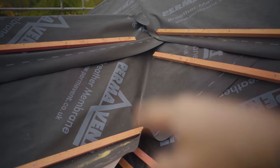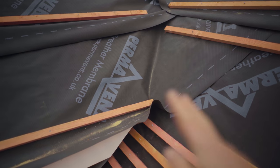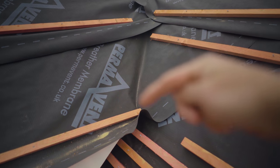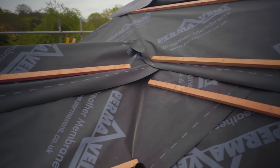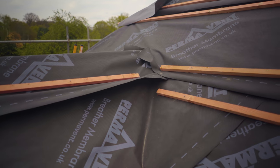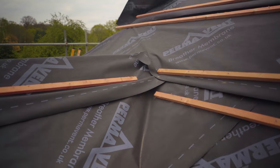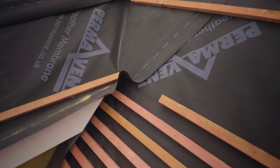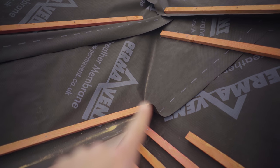With the battens, do I have them coming in and cut at 45 degrees, then coming off this way? Do I butt them up? I know you shouldn't put nails straight through into the valley in case water comes down — you want to be about 50mm either side. At the top, I can't muck down the ridge; I have to have vented ones, which I don't like but I have to have them. I believe you lead over the top — I'll double-check the drawings. I'm pretty sure it shows an actual valley with lead over the top, but I want the valley tiles.